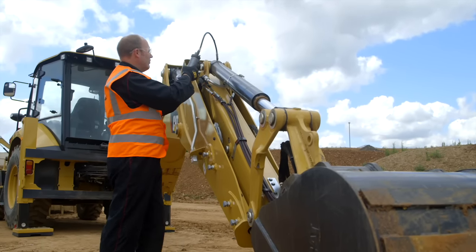Stick nose — check that's okay. That's the bottom end of the link. There's one thing everybody misses on this machine: it's the quick coupler. If you don't grease the coupler, it will seize up eventually, so you need to get some grease onto that. Since this machine has a quick coupler, there are no other pins here to grease.